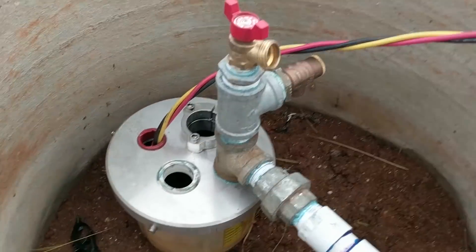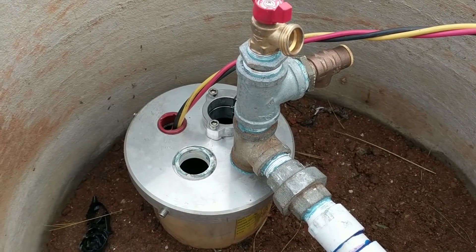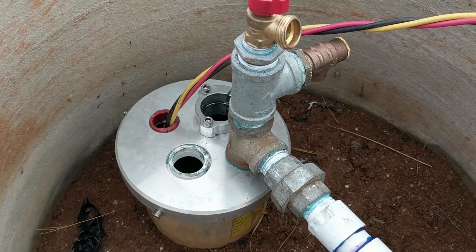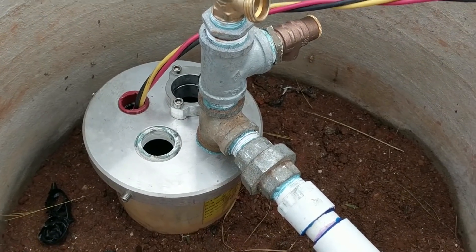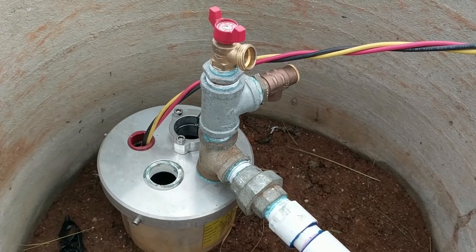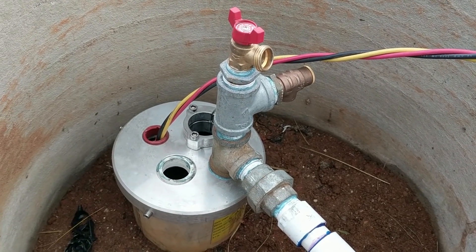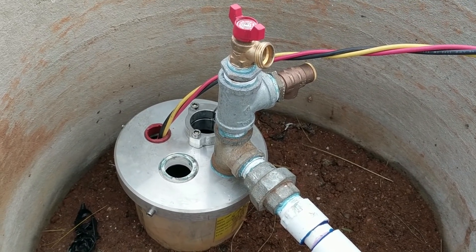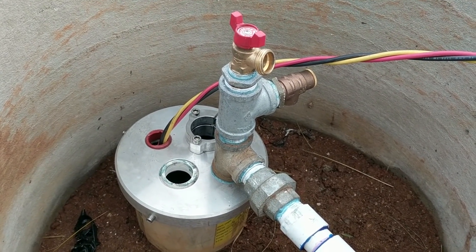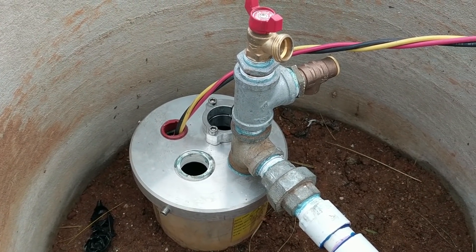To start this project, we wanted to see what we had. We came back and had to take a simple pump — a hand pump — back out of the well. The main pump was heavy, but we pulled out 190 to 200 feet of it. Took out some cable guards that were in our way — not all of them, just what was in my way. So we have prepped this well to insert the other Grundfos pump.